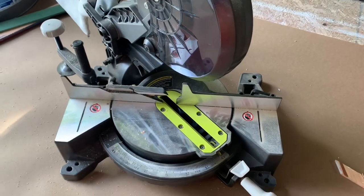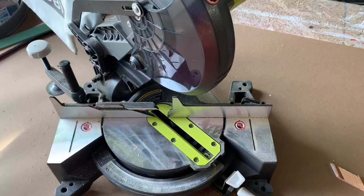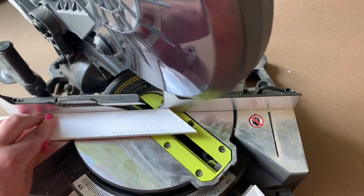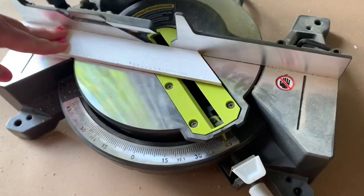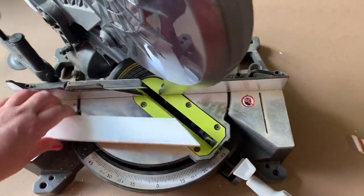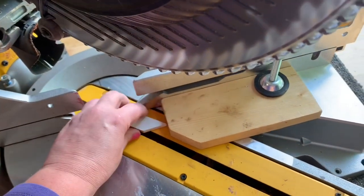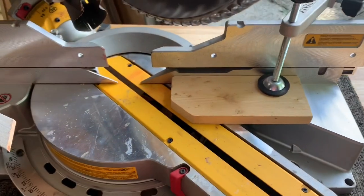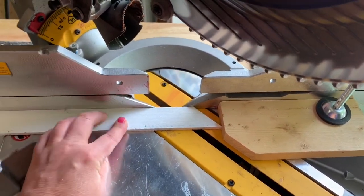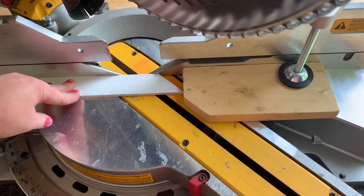When you're cutting your wood, you want all of these little pinwheel pieces to be the exact same size. You can do a few things — you could just line each cut up to the banding when you cut and they would be probably close enough. I've done that many times when I'm in a hurry. Or you could build a jig, which really is just a stop. You put the wood in and you can't go further than that, ensuring each cut is the exact same size. Just choose what's right for you.